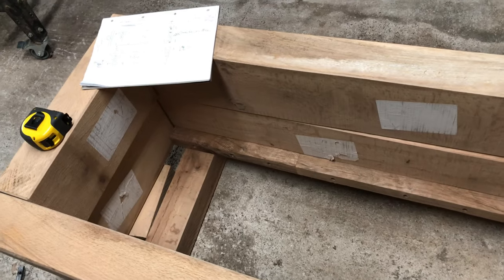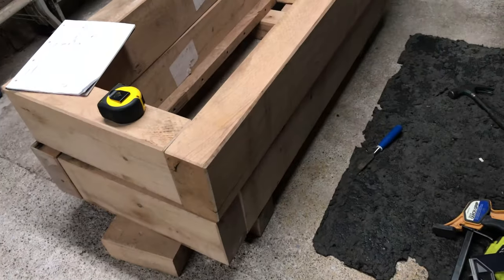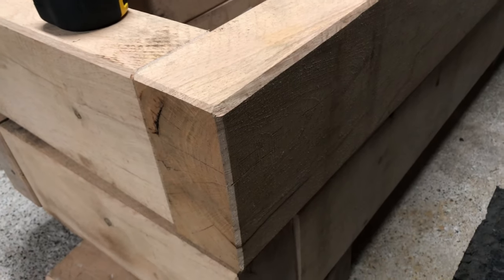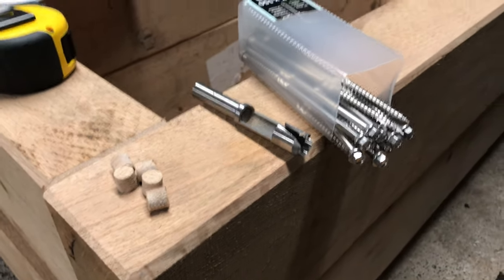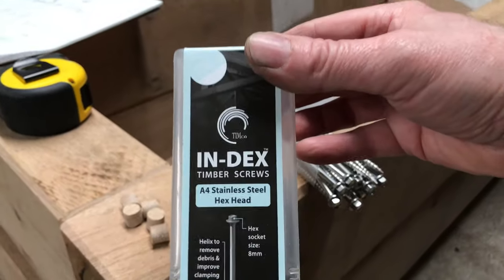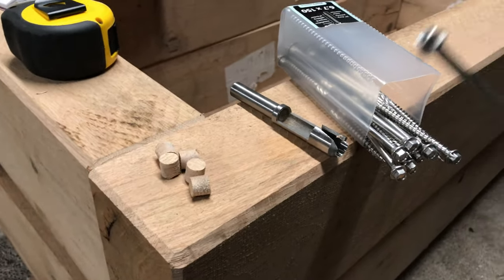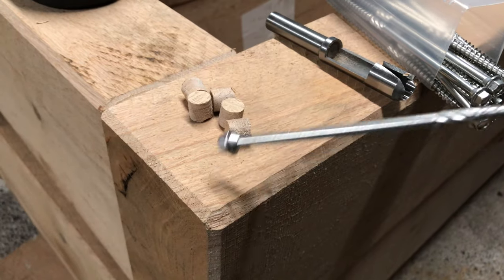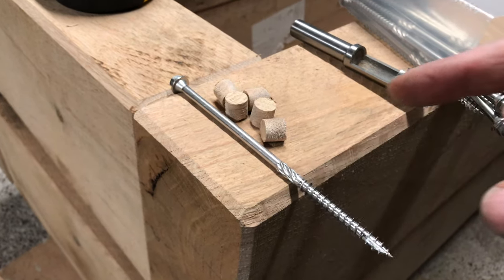So that's what I'm doing at the moment in the garage. I've got a plug cutter — you may have seen me demo a bigger one for another project in the garden. These bolts are going to be sunk in. Here are the bolts: they're stainless steel timber screws, 8mm head, 150mm long. This oak is 100mm thick, so I'm going to countersink them a little bit, giving me over 50mm into the other board.